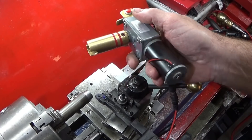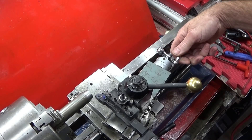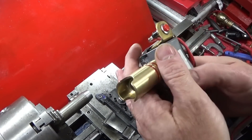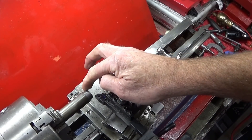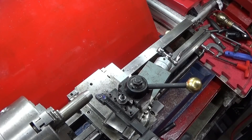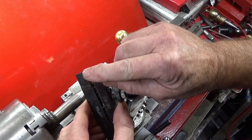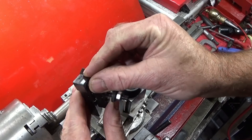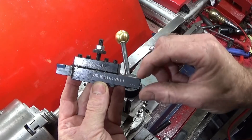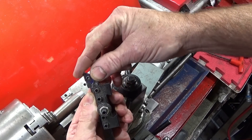Having a compound drive like this ensures that you get a very good finish on the angle, because you're not stop-starting by winding the handle manually, which you have to do if you're actually turning an angle manually. This one can drive over the full length of the angle so you don't get any stoppages and no ugly lines within the angle. Also, to get a good finish on steel or any other material you want to use the larger radius tools — I'll put a link below for these. These are the blue nano type; I'll put that one below. This is the actual tool, and I was very pleased when I went on Banggood to see that they do these large radius ones now.